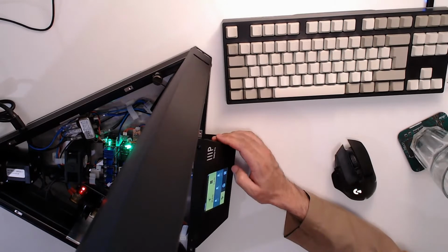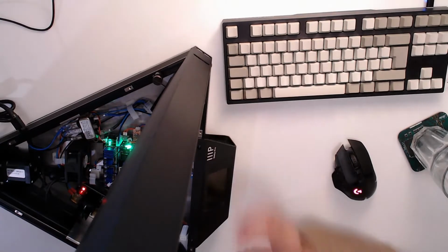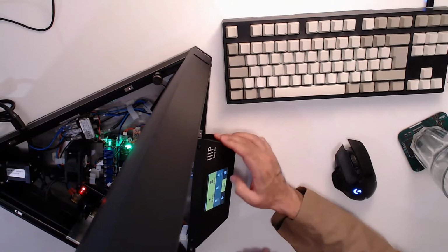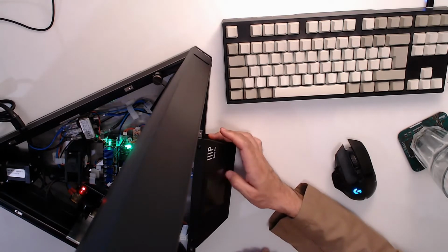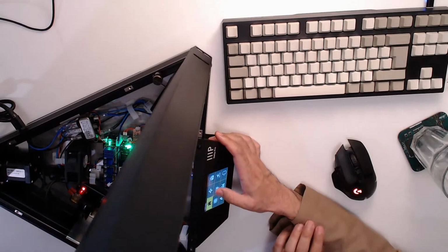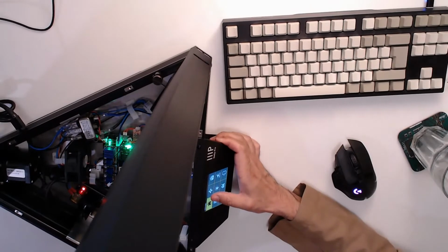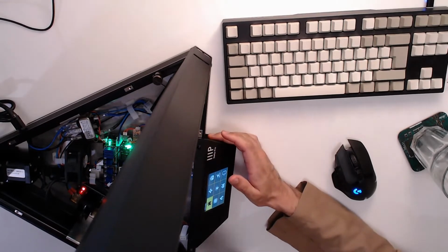I'll turn it off and on to make sure that value is set, and then essentially just keep my finger poised over the stop button while I try and home and move the machine and see if it works. The step values, yep, that's all there. Okay. So this home button should make everything return to its origin or 0 position. You can't quite see it from this camera angle, unfortunately. I click home. Nothing happens. Nothing happens because the motors aren't plugged in.